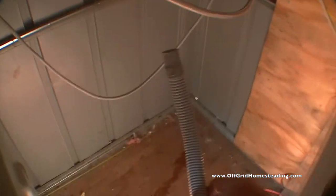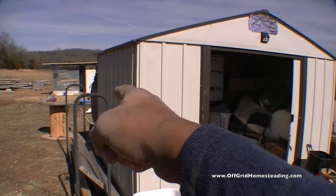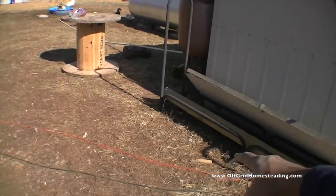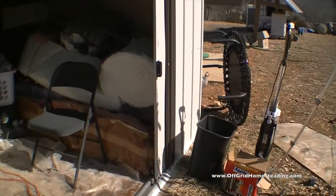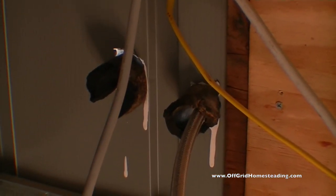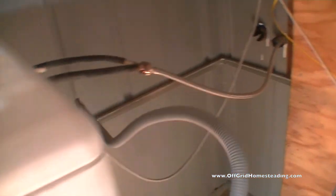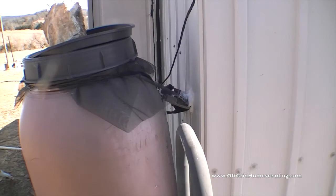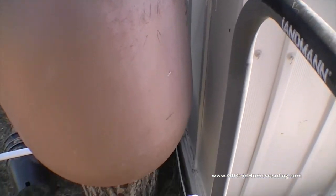Here was the challenge. We've got this little metal building that houses all of our stuff. What was happening is when I took the drain pipe and just put it on the outside, all of this area — there's water — it was just causing a major water problem. I made a couple holes into the back wall here of the metal building, put some rubber grommets around it. This drain hose is actually going to go through that hole. The problem was the water coming out of our drain hose was hitting the bottom of the building, actually leaking into the building from the base, and I couldn't stop the water from coming in.